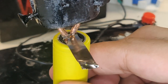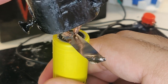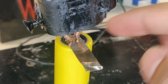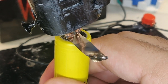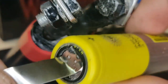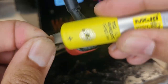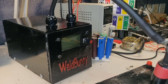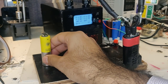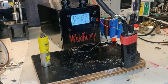The welds were spot on and impossible to separate. The welder is always available on demand — I can just flick the switch and use it whenever I wish. The only cost is the $15 I spent on the controller module, but you can factor in the thick grounding wire, the small transformer, and 3D printed parts — I'll leave a link in the description. With the Weld Bunny alive and kicking we're going to be building a lot of battery packs — one-wheels, skateboards, drones, all sorts of crazy stuff. A big shout out to my friend Remy who helped with the module and settings — go check out his kick-ass one-wheel build in the description. Keep engineering and thanks for watching.